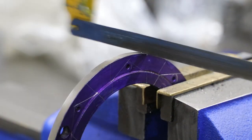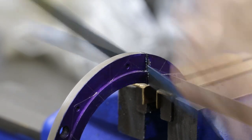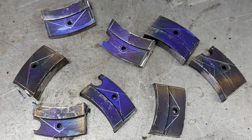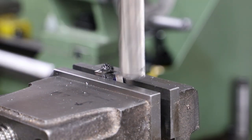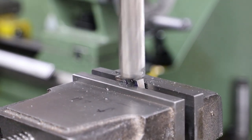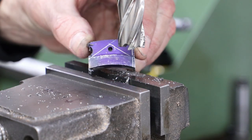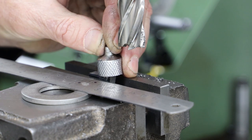To cut out the individual shoes, I first reach for my hacksaw. But after punching the vise at the end of the first cut, I defer to the angle grinder using a 1mm cutting disc for the rest. To square off the ends of each shoe, I move back to the mill and work by sight to the scribed lines using an end mill. After struggling to hold the workpiece for a bit, I remembered some good advice given by Bruce Volkerding and used a magnet to hold the parts as I locate them in the machine vise.